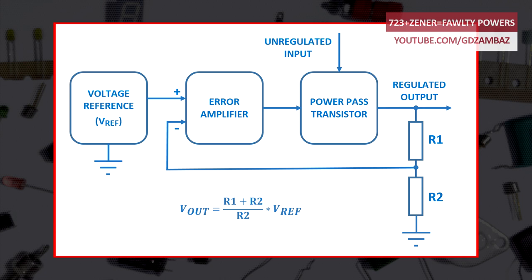The voltage regulator operates by comparing the actual output voltage to the voltage reference. The output voltage is fed through a resistive voltage divider into the inverting input of the error amplifier, while the non-inverting input is connected to the reference voltage. The difference is amplified and used to control the regulation element in such a way as to reduce the voltage error. For best performance the reference voltage must remain stable over a wide range of temperatures. The transistor in this role is usually termed a series pass transistor.